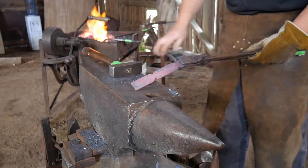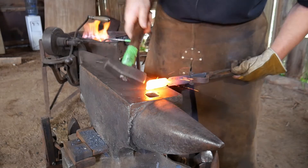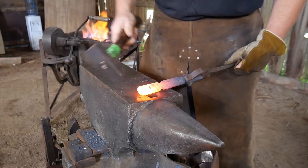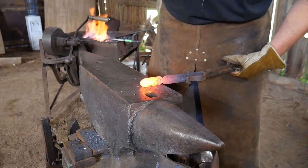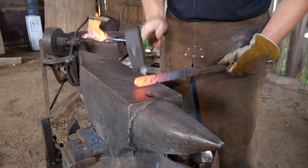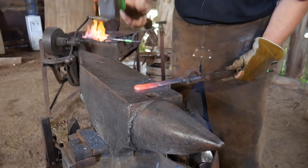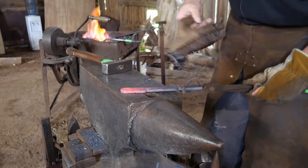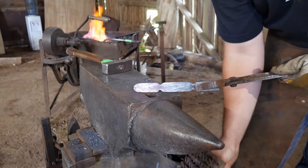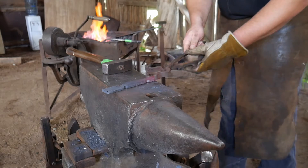The next step: we're going to round off those corners on both sides. With the piece nice and hot, we're going to use a really steep hammer angle with back-face hammer blows to knock a 45-degree bevel on the flat - same on the other side. Keep working that together almost like we're trying to forge a really blunt point at the tip. Then we'll round off the rest of the material into that rounded tip. We pulled out two separate lobes, so don't worry about any carp's mouth at the end too much at this stage.